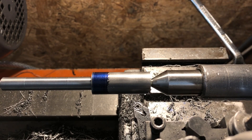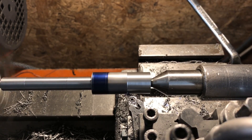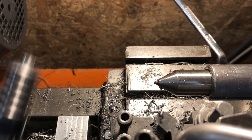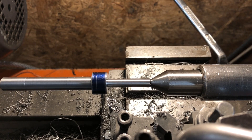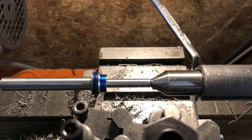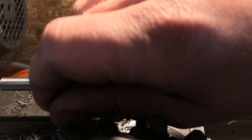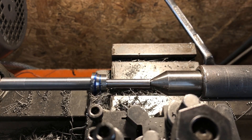This section takes the worm, so I just need to turn it down to fit. The plans call for 0.249 but I've checked the bore and it's a very close fit on an odd piece of 0.251 silver steel I have lying around, so I'll aim for that. Turning by eye to the scribe line with a carriage stop set for length, we get a nice fit on the worm. The final operation is to profile the central shoulder — after removing material with a standard tool I switch to a form tool. There's no radius called out on the plans so I pick a suitable looking tool, then decide the radius looks a little too large and swap to a smaller one. A light chamfer completes the part.